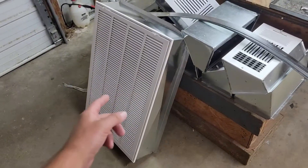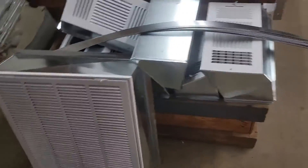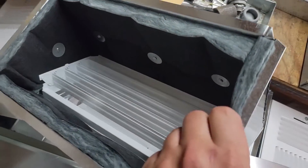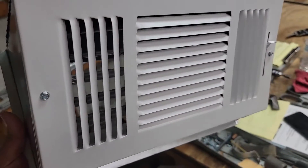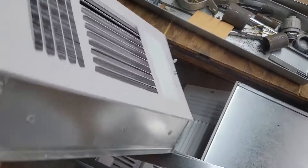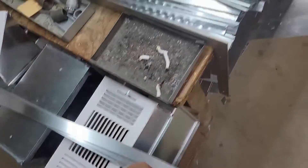We've got a four-ton unit. This is the before — I'll show you the after. The guys are in the shop. There's the return box that they built — a 20x30 return grille. Here are the custom boots. Really nice job on these boots. They're insulated with a one-inch liner, with a 6x12 ceiling register in the middle. These are so nice. They've also got some straps here, probably for hanging the duct.